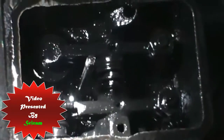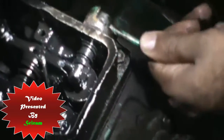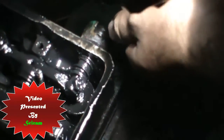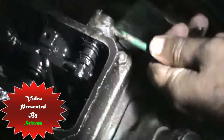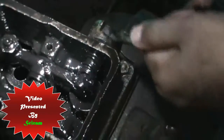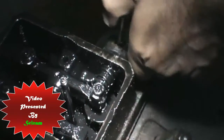What I am operating now is the decompression lever, and here is the decompression lever which is on the exhaust valve. Now this is the other view — as I operate this decompression lever it depresses or opens the exhaust valve so that as you manually crank the engine you would be able to rotate it.